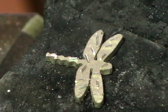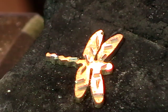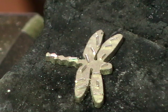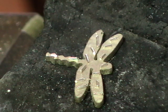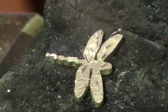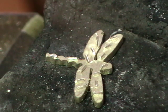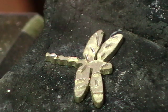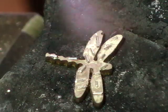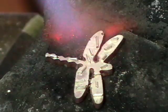I'm using the Smith's mini torch with a neutral flame — you can pretty much use any torch for this. We're going to just gently heat this until the flux dries out. Once the flux dries out, the solder will be held in place, then we can bring it up to temperature. We want this solder to just start to flow. So that's dry — just circle the piece. It doesn't have to go everywhere, but if it just starts to melt, that's good.